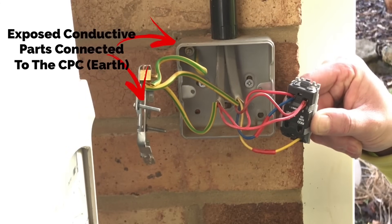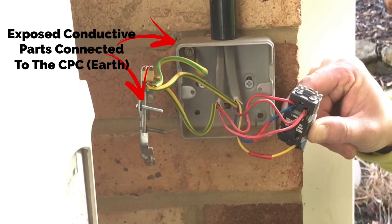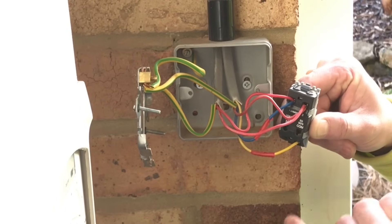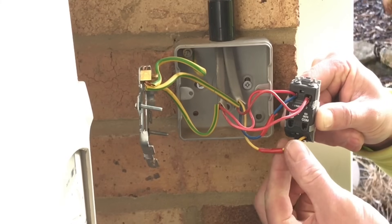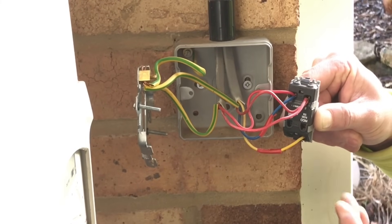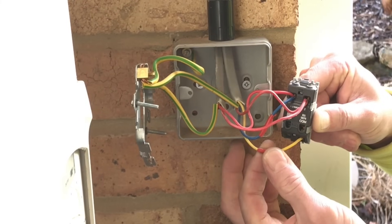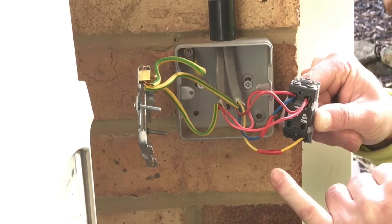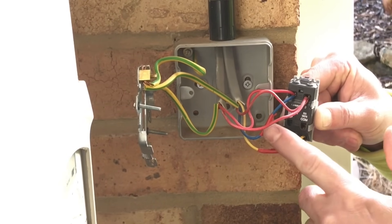Looking at the back of the two-way switch, we've got coming down from the light fitting twin red. We're used to using twin brown at my college but we've got twin red coming down here, and we've got the three core which is red, yellow and blue. In this case the common connection has been made using the yellow conductor. Could have used red or blue — as long as the common is the same at both ends it wouldn't matter — but this electrician has used yellow as common. He's identified both the blue and yellow conductors, which are both switching line conductors, with red tape.